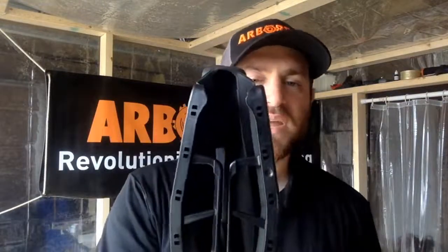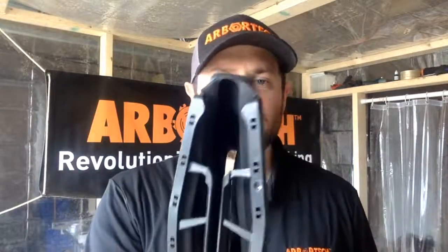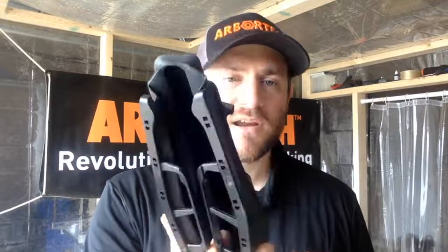It's got some nice flexibility to it. It has a rigid base, so if you are running it up against your mortar, your brick all day where that's going to be hitting, this isn't going to wear out anywhere near as quick as some of the old components. It's going to give you that long-lasting life of a nice piece. Even though it is just a standard attachment, this does give you about 80 to 85 percent dust extraction or dust removal, depending on the unit that you have.